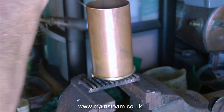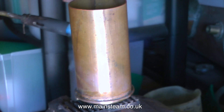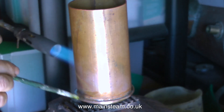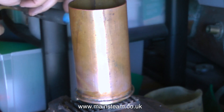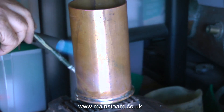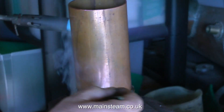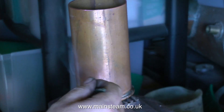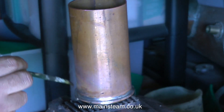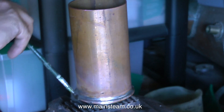This is a stainless steel fire grate I use for silver soldering. I am aware that fire brick is better, but I don't really have the room — my workshop is a very small area. I'm not silver soldering this by the way; I'm soft soldering it. What I'm doing at the moment is brushing some flux and water mixture around the edge, which really makes the solder flow. This is electrical solder, and initially I feed the solder in around the inside edge. This is not a pressure vessel — it is always open to atmosphere — and soft solder is perfectly adequate because it also has water in it, so it will never get hot enough to melt the soft solder.